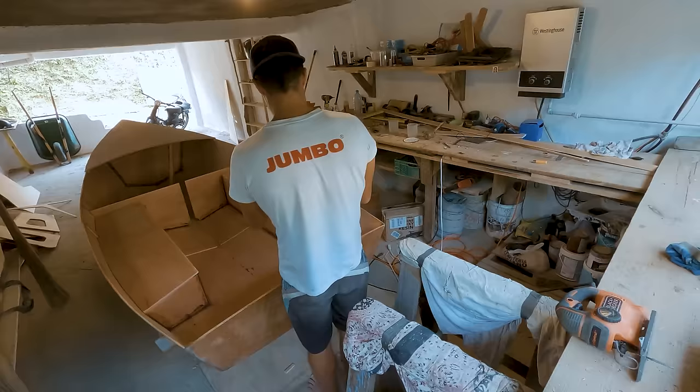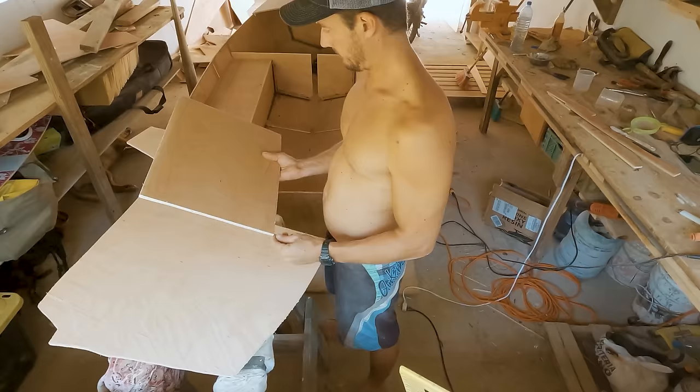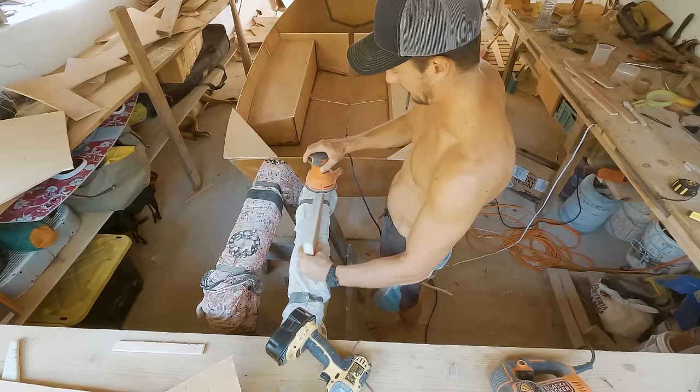I also made two quarter knees that will be glued at the stern corners to add strength. Next, I cut out and measured all the plywood pieces needed to create a dagger board case. Then I started gluing the dagger board case together and also glued my quarter knees with the same batch of epoxy mix. Anytime I had leftover epoxy from a batch, I would apply it to the boat either as fillet joints or as sealing coats, trying my best not to waste any of it before it cured.